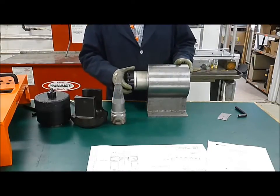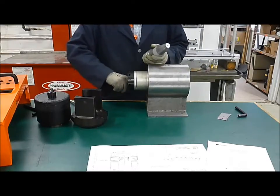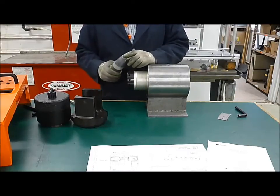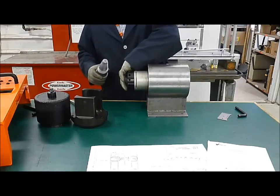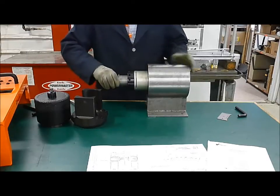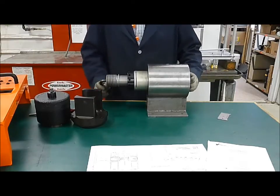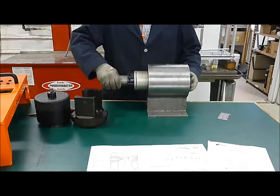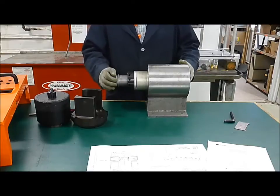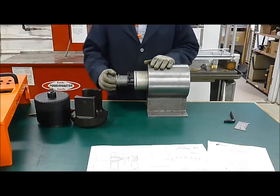The spanner ring can go on first. Take your puller screw — make sure the threads are clean here and make sure the threads are clean inside the stud. That's covered in IM-220, also found on the Riverhawk website, for cleaning the inside of those threads. Place the core screw in the hole, put it in hand tight, snug it up with a wrench, back it off a quarter of a turn, and just snug that up by hand — it doesn't need to be tight. If this is a dirty connection, you'll feel it in the puller screw — it won't be a smooth connection between those two.